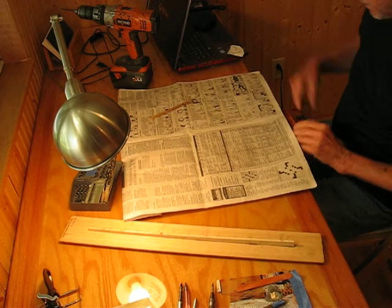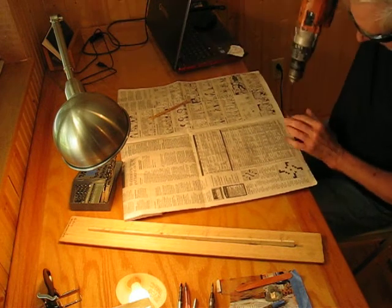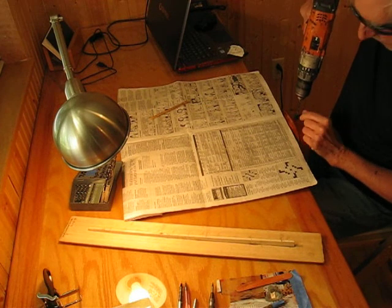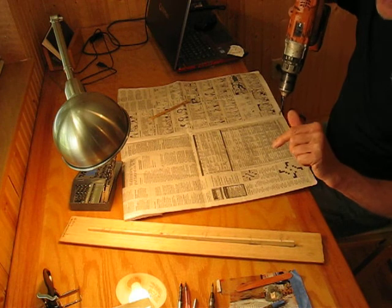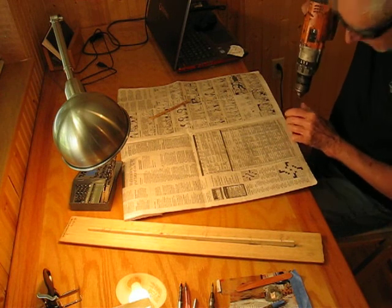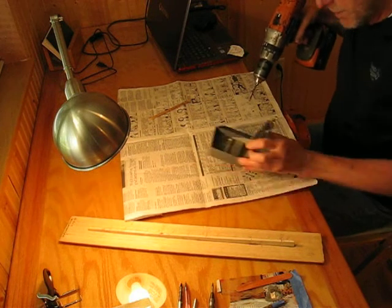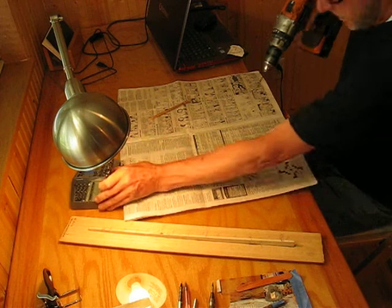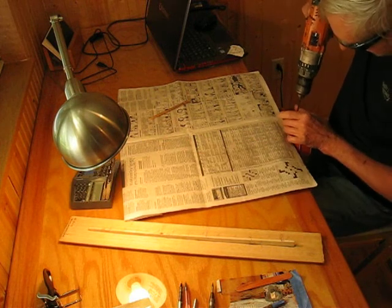Let me go just a slight bit further. You don't want to drill all the way through though. If you go down a ways and you're concerned you're almost going through the end pin to the inside, switch to a larger drill. This is a number 23 drill — not a bad place to start.